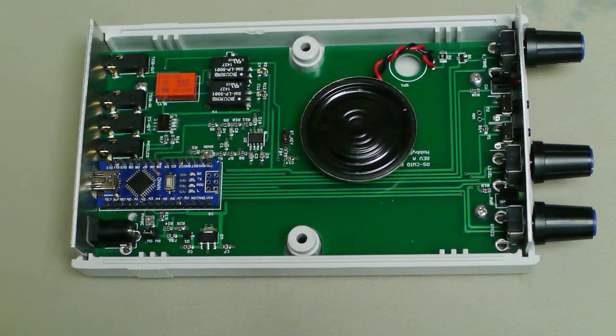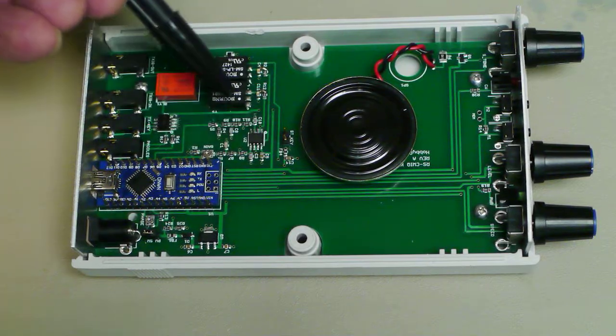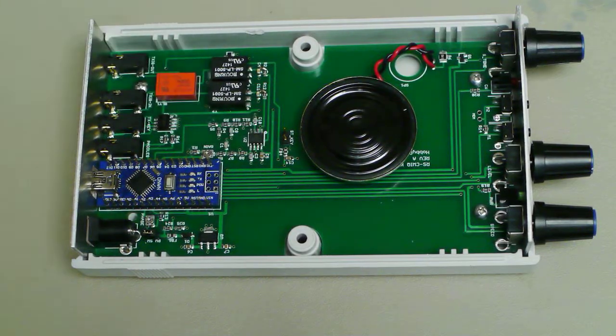There's a pretty generous speaker, so the side tone can more or less fill the room. And this circuitry in here is simply the analog filters needed to clean up the PWM signals created by the Nano and make nice, clean sine waves for modulating the transceiver.